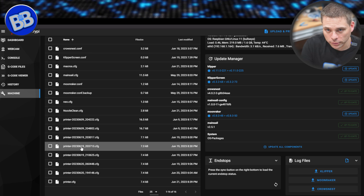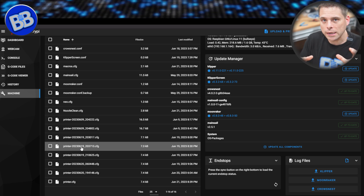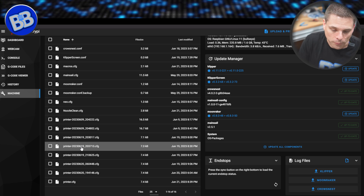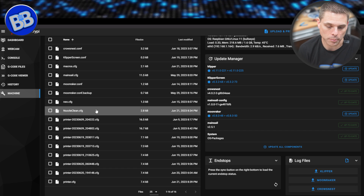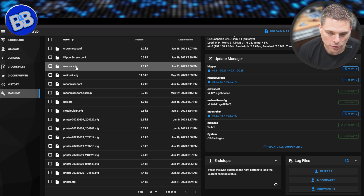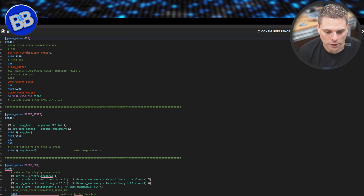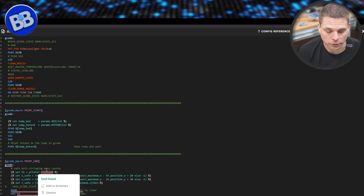What we have to do is tell the printer two things: we have to tell the printer to enable us to set the start print temperature that we're going to get out of our slicer as a variable or saved state, and then re-enable that at the end of our start code for the printer. So looking at my configuration, rather than having it in printer.cfg, I have my printer start in my macros config file — which is a really good name for a bunch of macros.